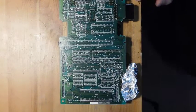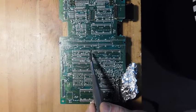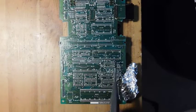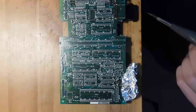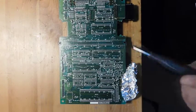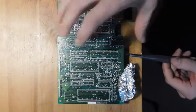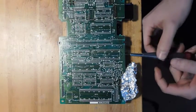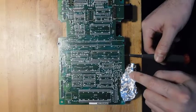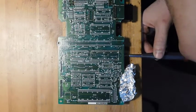Now we're ready for the third and final part of removing the PPU — using the heat gun. Most of the solder was removed by the desoldering gun, but there's still a little bit left, so forcing it off would rip traces and cause damage. Instead, I'll pass the heat gun over the entire chip while using a flat-tip screwdriver underneath to put a little pressure on the chip. As the solder melts, it will loosen up and allow me to slowly pull the chip down without damage. I also have aluminum foil on the plastic parts to protect them from the heat.